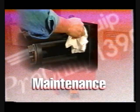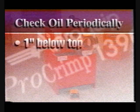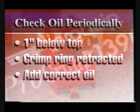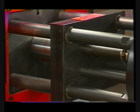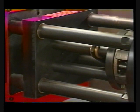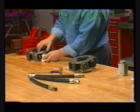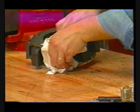Maintenance. The oil level in the fluid reservoir of the hydraulic power unit should be checked periodically and maintained at a level one inch below the top of the reservoir. The crimp ring should be fully retracted when checking the oil level. If necessary, add the hydraulic oil referenced in the owner's manual. All sliding surfaces of the ProCrimp 1390 must be kept free of dirt and other abrasive material. All exposed black metal surfaces should occasionally be coated with a light film of oil to prevent corrosion. The tie rod should be lubricated periodically with never-seize. In addition to die cage lubrication at 50 crimp intervals, periodically clean the die cages and crimp ring to remove old lubricant, then re-lubricate these parts.